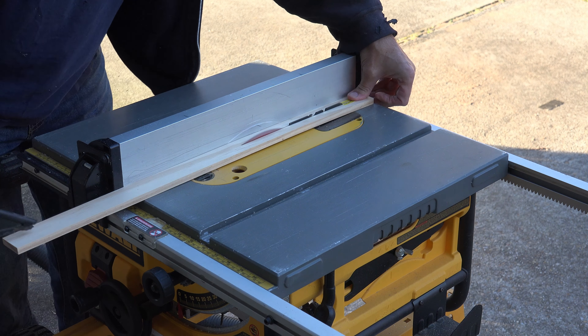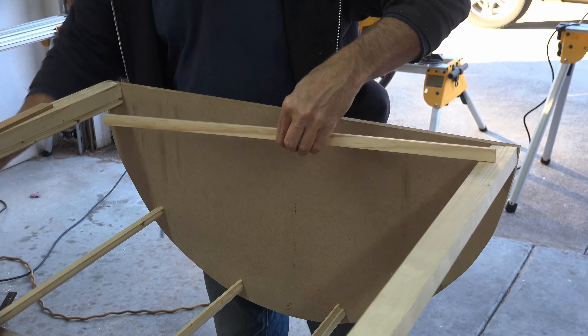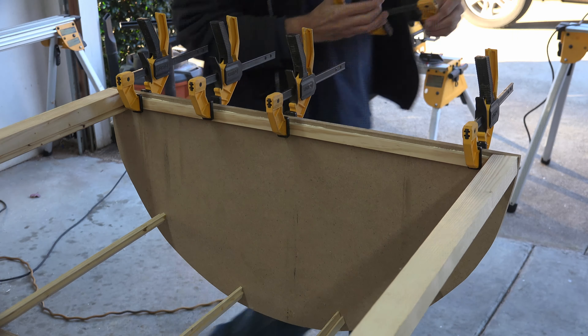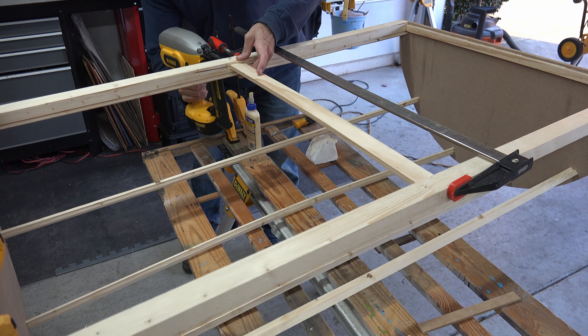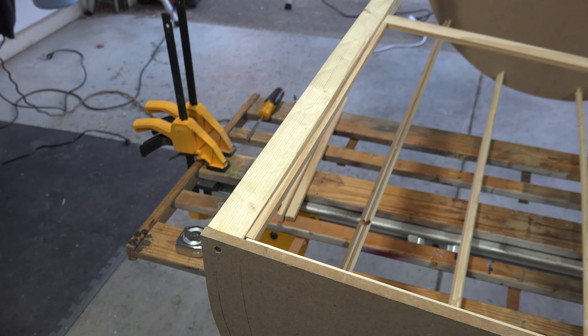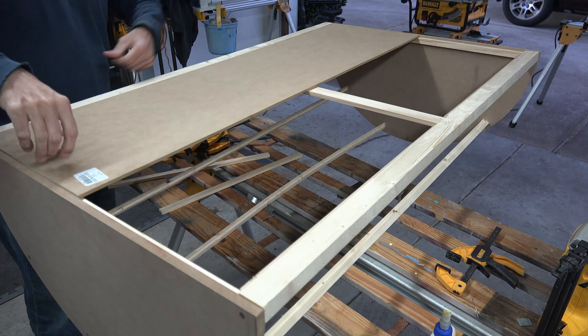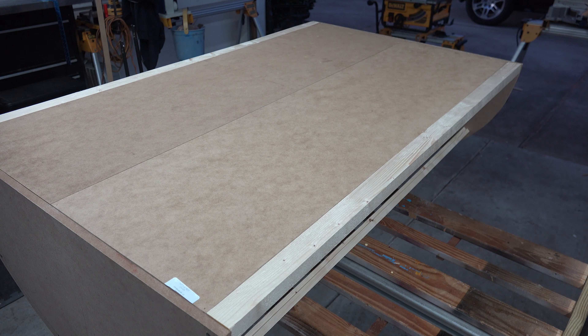At this point, I decided that I wanted the backplate to lay inside the frame, kind of like a shadow box backplate does. So I cut strips to go around the inside of the frame so the backplate could lay on those and be flush with the very back of the arch. I simply glued them into position using a scrap piece of the backplate to ensure I was flush, then once clamped, I stapled them into place. Knowing I would be placing shelves inside the window, I gave the backplate a little more support by placing a crossbar in the center of the back, slightly lower so the backplate could rest on it. Then I finished adding the rest of the lip on the sides, measured and cut my backplate ends so they would lay into the lip of the back, and tacked them into position. Remember not to tack them into the crossbar — I will show you later why.